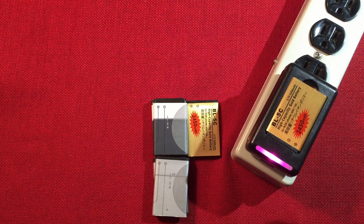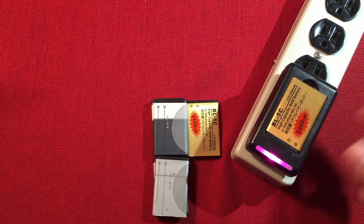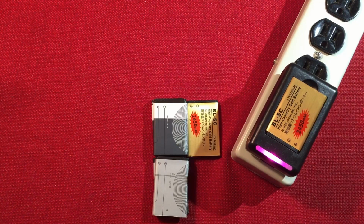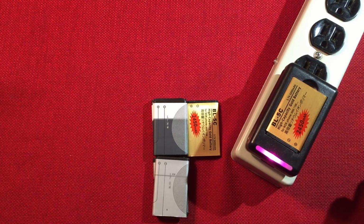Typically, using the radio, plugging it in, it was taking like 12 hours, almost 18 hours to charge this battery. I don't know if it was just a defect of the radio. I just couldn't trust the charging circuit on my radios. So I trust this one actually a bit better. I found out that 80% peak charging is okay, but it does shorten the life of the battery over the long haul.